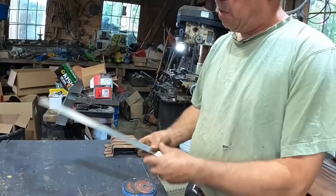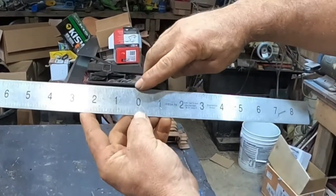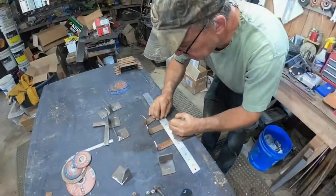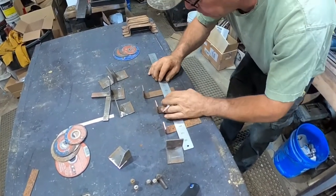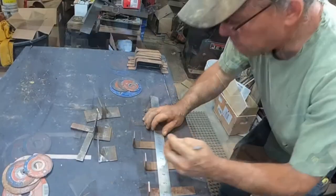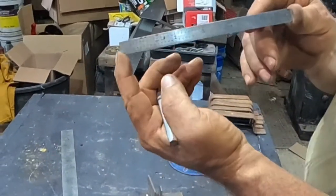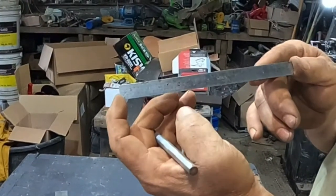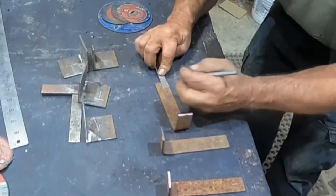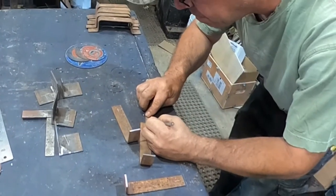This here's a cool little roller — it's a center roller, the zero is in the center, and you can find center on your piece of steel relatively quickly and easily. I like to be precise. You can either do a good job or a bad job and both take the same amount of time, so why not do the good job the first time around? Now use this little ruler — it measures in thirty-seconds and sixty-fourths of an inch — and we'll measure up a half inch. That will put that bolt right dead center and make it look neat.